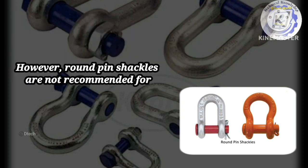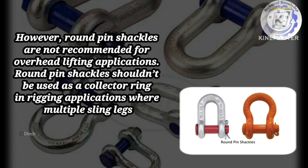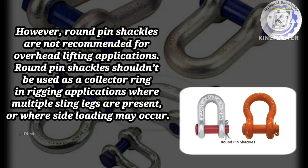However, round pin shackles are not recommended for overhead lifting applications. Round pin shackles shouldn't be used as a collector ring in rigging applications where multiple sling legs are present, or where side loading may occur.